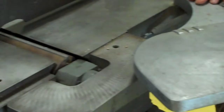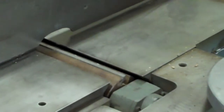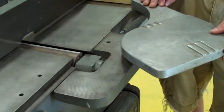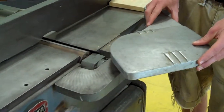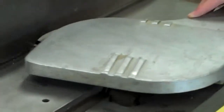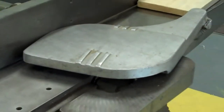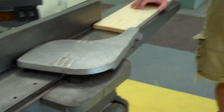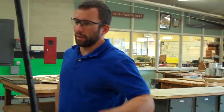All right, and you see there the blades. There is a 3-blade cutting bit, and they're a long bar type cutting blade. Actually, those blades were just replaced, so they are very sharp. This thing does take off wood chips off a piece of lumber, basically like chips. So again, we want to be very careful with our machine operation to make sure we don't get fingers or anything like that stuck in this machine.